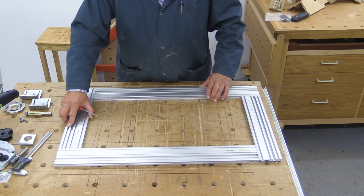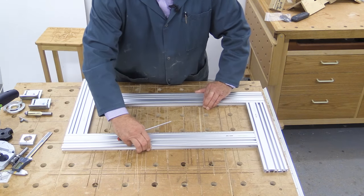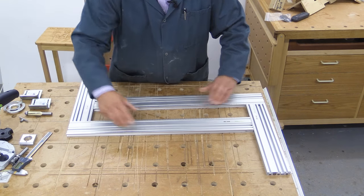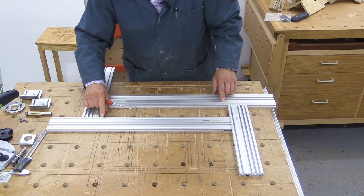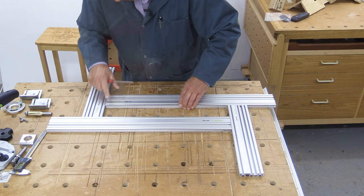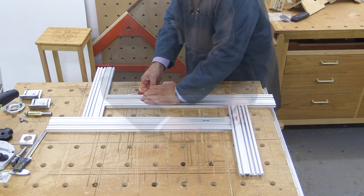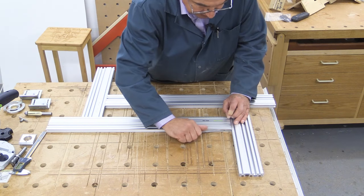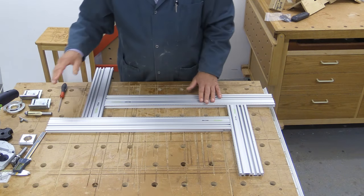The simple version of the concept is you would adjust your MFS to the exact size of whatever it is you want to do. So I've set this and I've got that one on 500 millimetres, that one on 500 millimetres, and I've just adjusted this one - that's on 80 millimetres. So now I've got the size that I want, and then you'd use your router.